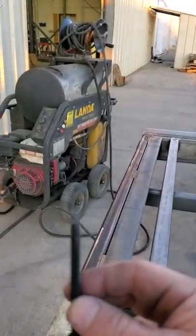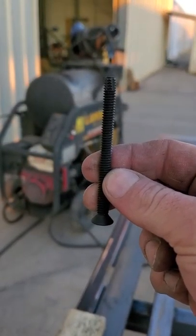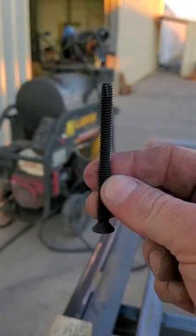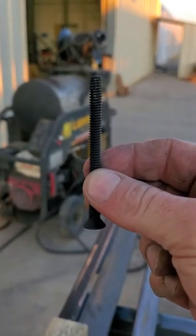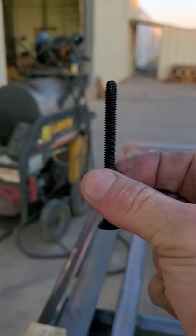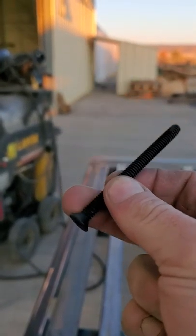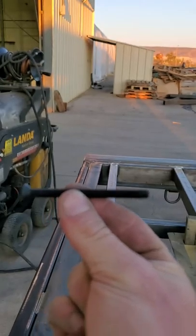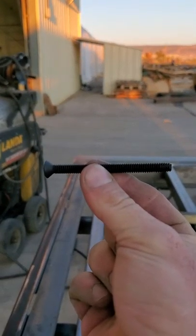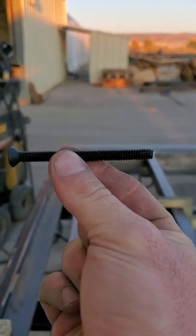GRK Grabber has some of these types of screws as well. They're self-drilling — these are not self-drilling, they're only self-tapping. You can see that Type-F thread up there on the top. See that little slot at the top of it — that's what cuts the threads. It's a Type-F and it's got a little bit of a taper to it, so it goes into a seven thirty-second pilot hole really well.